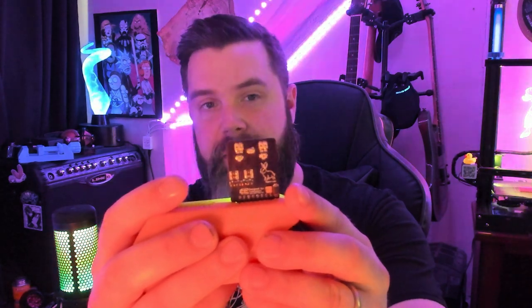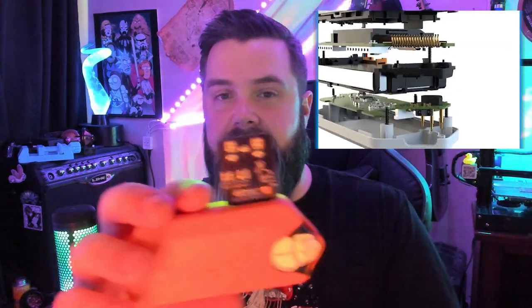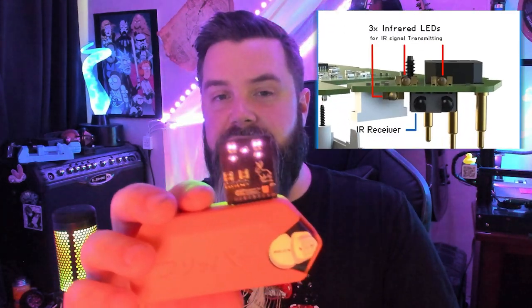One thing to keep in mind that I've run into using the 5 volt and the GPIO — for some reason, sometimes it does turn itself back off. You'll notice on here it's got a great green light, though it's hard to see because I've got my recording lights on. So if that ever turns off, there's a good chance that 5 volt just turned itself off in the GPIO settings. It's not a big deal, it's just something that happens sometimes.